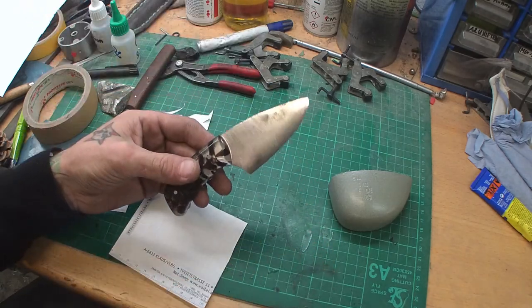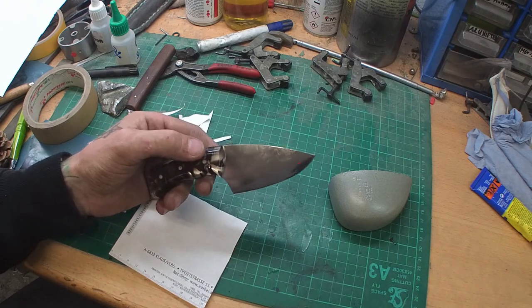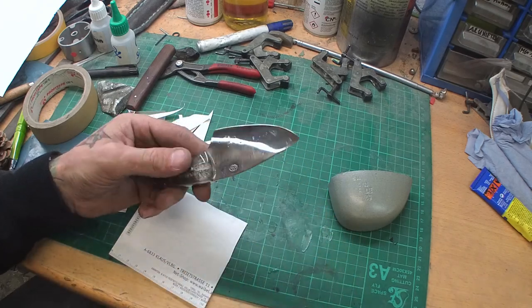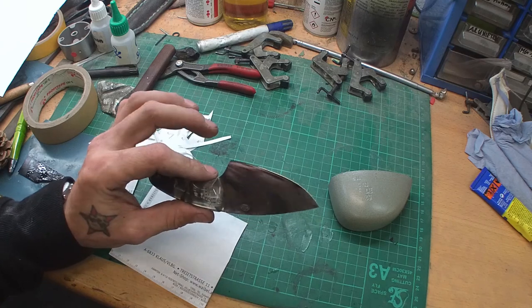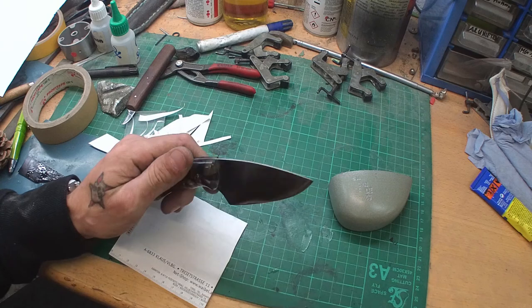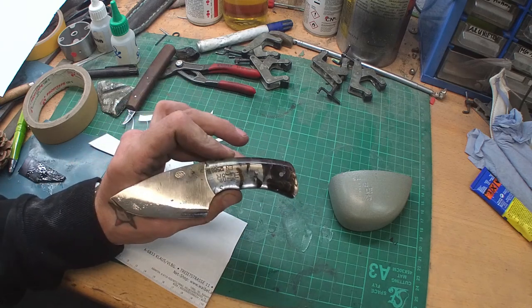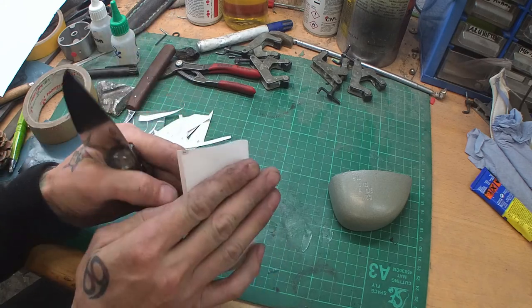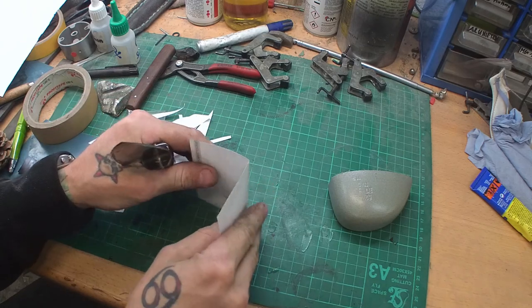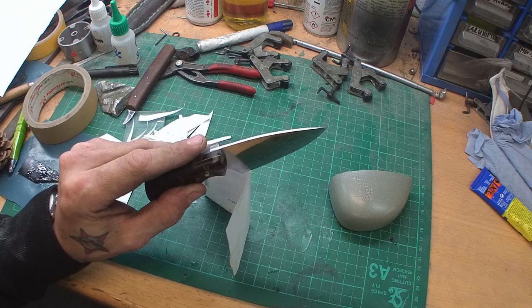It's like a kitchen knife or a skinner knife. It's made for soft tissue, it's made for soft wood. You should not even cut extremely hard woods with it, like hickory could be already too hard, but it would work, but ebony wood or something like that, I would not recommend to cut with a knife like this, because its edge geometry is just not made for it. And that's why it glides through this standing paper like nothing, because the edge geometry is just as awesome and as thin. That's the main point.